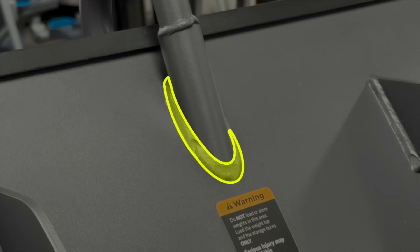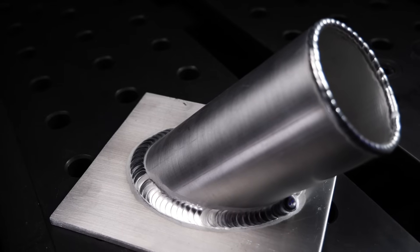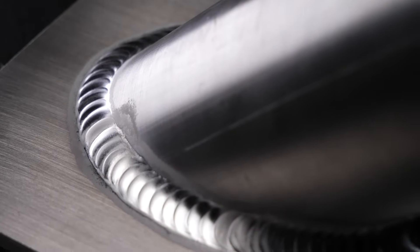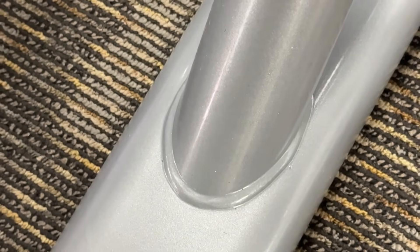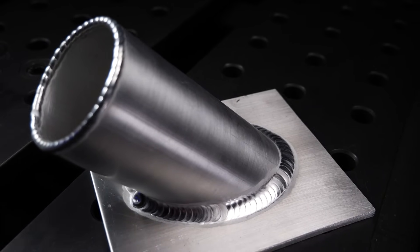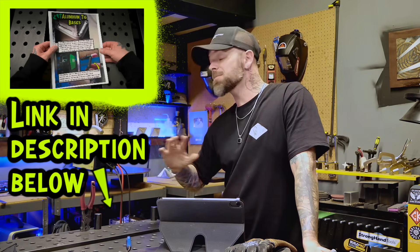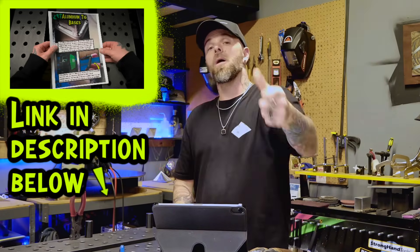Practicing this around pipe joint fillets is a great way to build consistency. I recommend getting good at doing it around 90-degree cuts around pipe first, and then start practicing around an angled piece of pipe. This is where things get really fun. Looking around this machine, we can actually see some other stuff that has been done really well around pipe just like this — see how good things can look when you build your consistency. When you run around the outside of a pipe on an angled cut, it looks awesome. Keeping structural integrity in mind and preventing areas where consistency falls short — breaking down work we see out in the wild is one of the best ways to get feedback and develop skill with your own work. In no way do I ever want to seem like I'm picking on somebody else's welding. Go download the workbook — it is absolutely free, you can print it out, and it's got tons of great stuff for beginners.